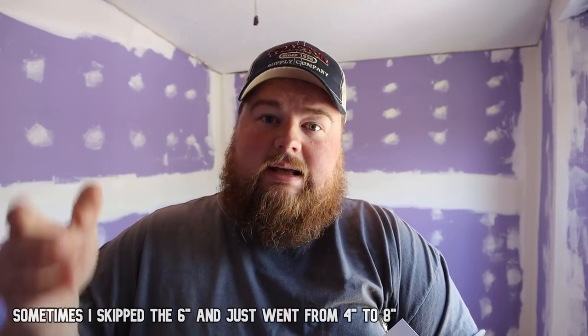Well, with these joints between the drywall boards, like these big horizontal stripes you see behind me, I have found it's best to start with 4-inch, do your compound, wait a day. 6-inch, do your compound, wait a day. 8-inch, compound, wait a day. 12-inch, compound, and wait a day. This allows you to build up the manufactured divot that's in between these two boards where they join with the right amount of compound, the right thickness, for the best results. And so far, we've done all the work in here with zero sanding and zero cleanup. So that's really good, especially for us.